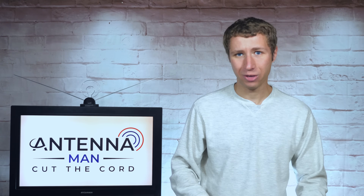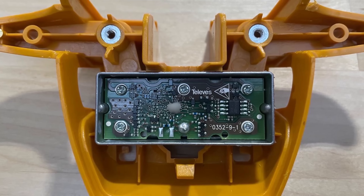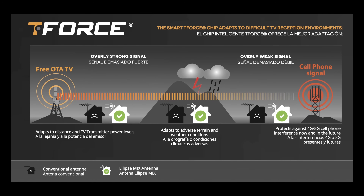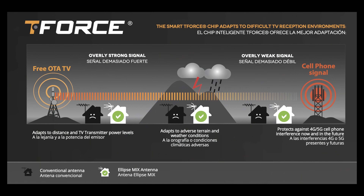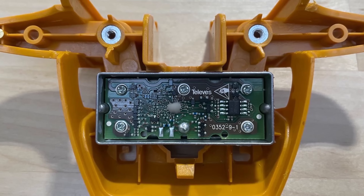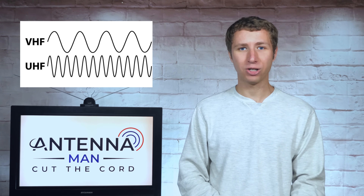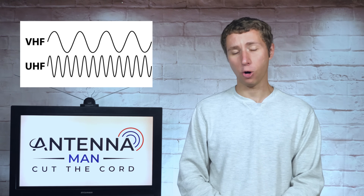A large folded low VHF dipole and low VHF reflector have also been added onto this antenna to make it low VHF capable for TV stations that broadcast on RF channels 2 through 6. The low VHF improvement over the prior tri-band version of the Televis Long Range Mix is about 5 dB thanks to these changes. Televis did not stop there — the built-in preamp has been totally redesigned. Not only does it filter out higher frequencies to avoid 5G interference, but it's basically two preamps in one now. VHF and UHF are regulated independently as needed instead of together.